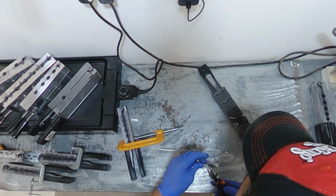Now let's move on to our worm weight mold. This one can be a little bit tricky just because it's so intricate, but the main thing is use the graphite spray, and you need to have your lead extra hot, and you need to try and get the mold very hot also. You can see with the graphite, the pins pull out much easier.